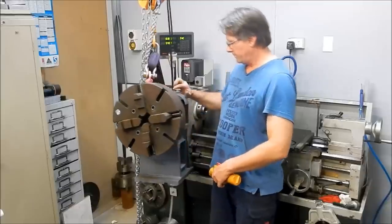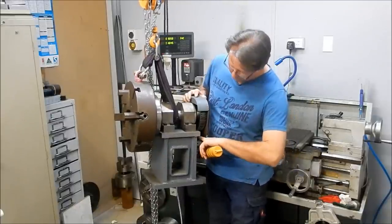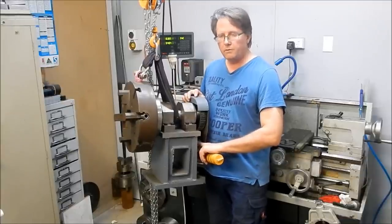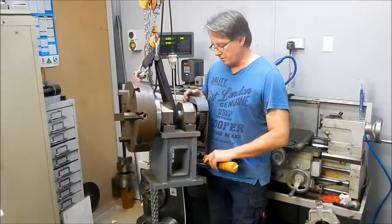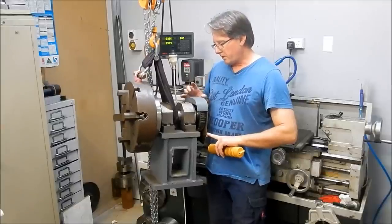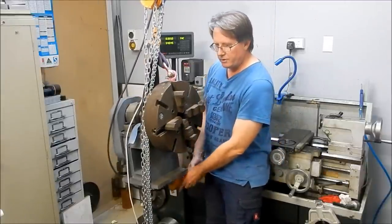That's my arrangement. I'll pop in there and have a look at the gearing a little bit later on, but as I said, I've got mine sitting in around about a 2-to-1 ratio, so I've got a larger bull gear here. I have an idler gear, which is made out of Nylotron, which basically reverses the direction for me with the gear sets. With Johnny's arrangement, you have to run the lathe in reverse to cut normally. With having the idler in there, it actually reverses the gear direction, so you don't have to worry about trying to run the machine backwards. So, at the end of the put together, I'll take this down, take the guards off, and we'll have a closer look through it. But that's how she looks.